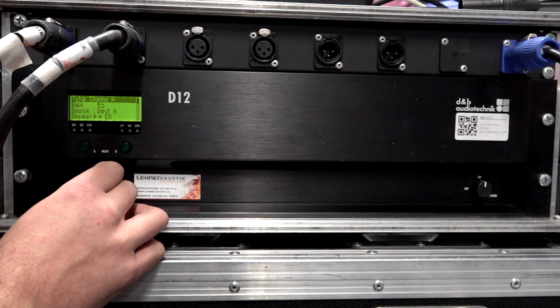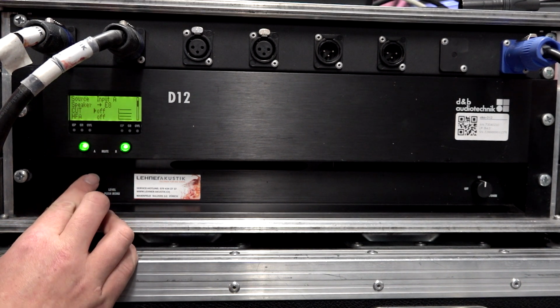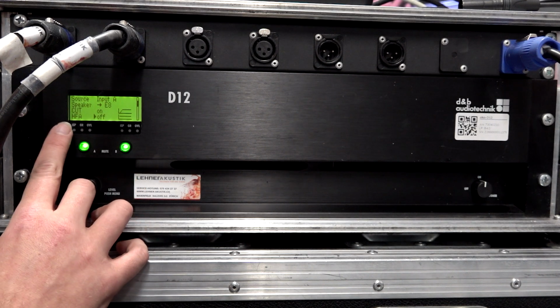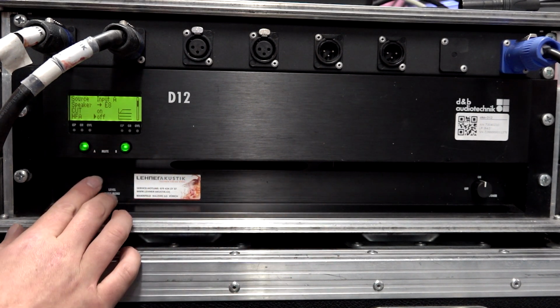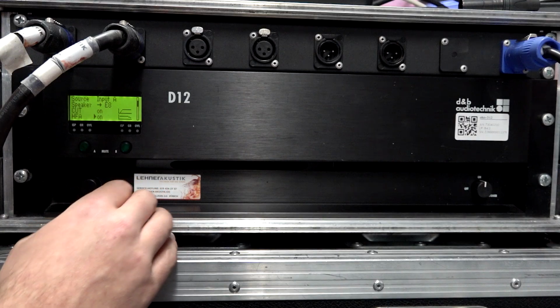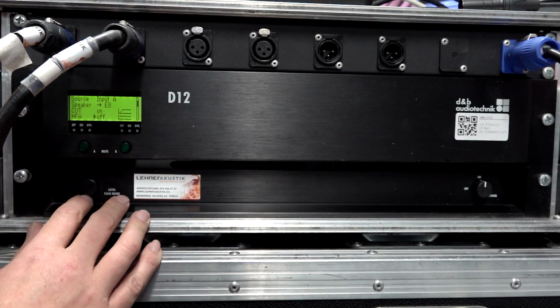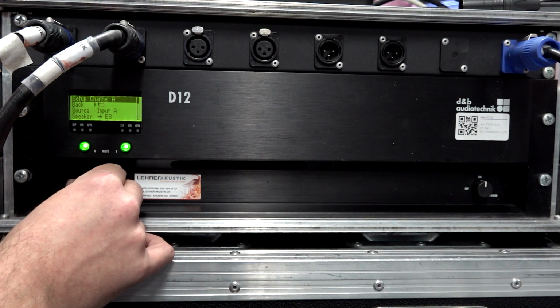We have other settings that we can configure in here as well. For example, we have a cut, which will put on a high-pass filter. We also have a HFA, or high-frequency attenuator, to shelf high frequencies down slightly. Whether we want to use them or not will depend on the type of event that we are doing. In our case, we're doing a video conference. So we don't need a high-frequency attenuator, but a low cut would not be a bad idea.